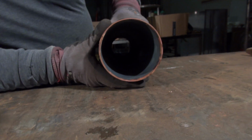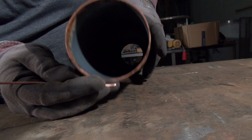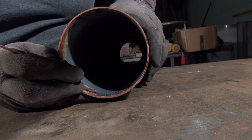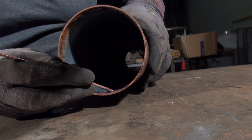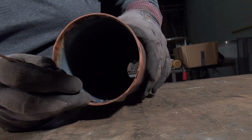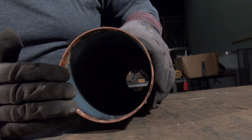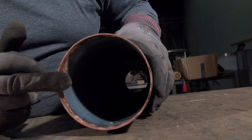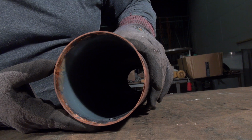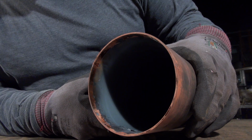On the other hand, we have something that looks somewhat more serious here. What we are seeing here is something different. It's flaky, which very much leads to the idea of real oxidation. It looks like the inert atmosphere didn't really reach this point. This part down here was actually against the bottom of the oven, and it wasn't properly spaced from the bottom of the oven. So we have a theory that the inert gas simply didn't enter this region here.